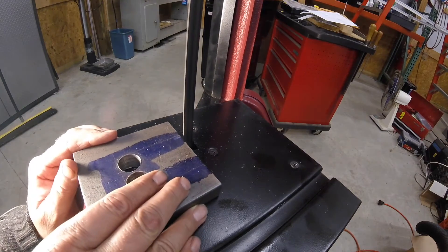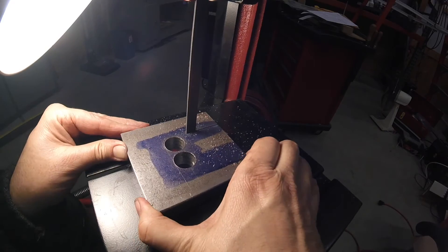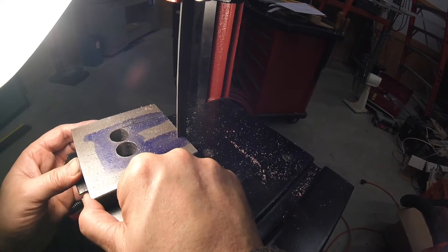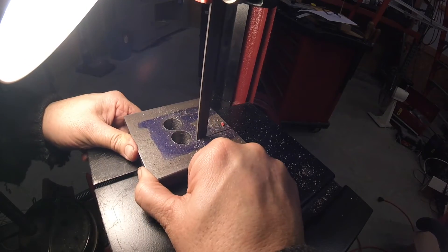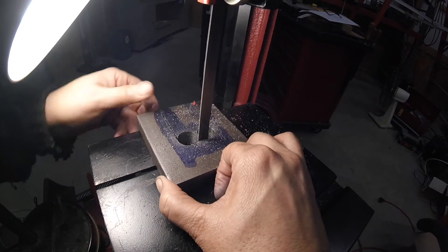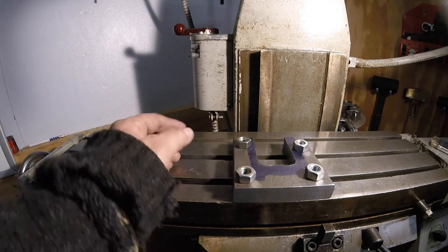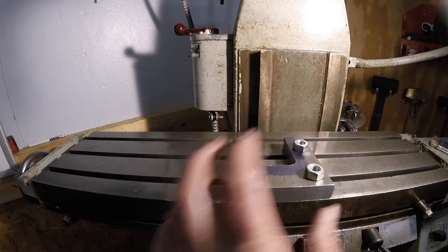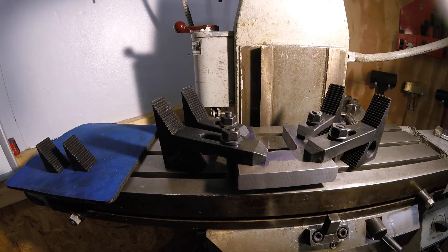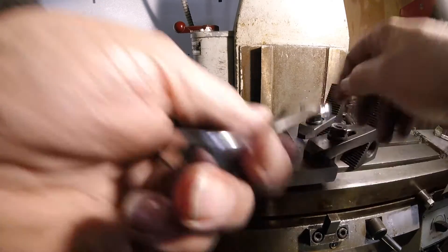Let's cut it along the lines — just shy of the lines. What I was going to do now is just use four nuts as a standoff, so that way I can get this thing against the table. If I grabbed it in the vise, I'd only be holding it on one side. This is the one I'm going to lock — the rest of these are just kind of there, I'm just putting them finger tight.